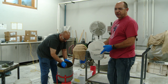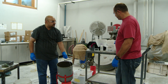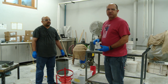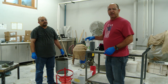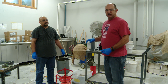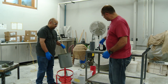The limestone in our mix represents our non-reactive aggregate. So our fine aggregate is going to be our reactive aggregate that we're testing. We have our water already measured up. The test says that you need to have your alkali content be at 1.25%. We add additional sodium hydroxide to our water in pellet form to achieve that, because normally our cement is about 0.6 total alkalis. So to get it up to the 1.25 we add additional sodium hydroxide to our mixed water and dissolve it. We already did that.